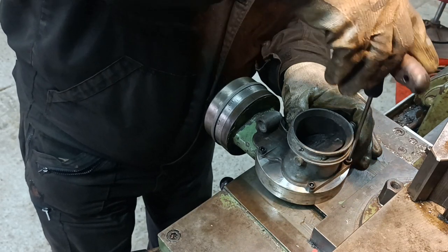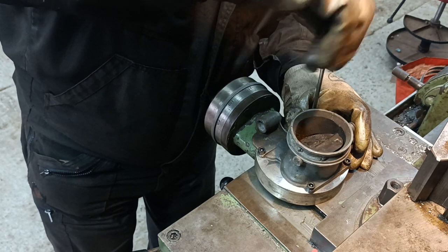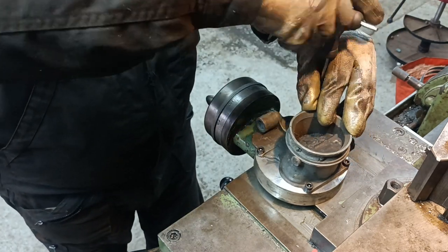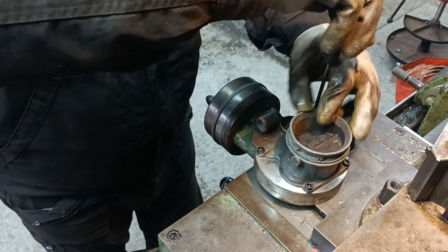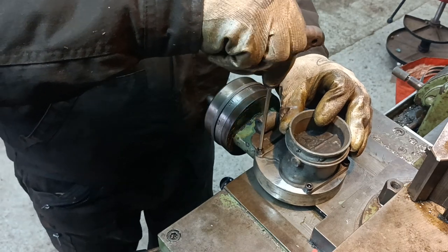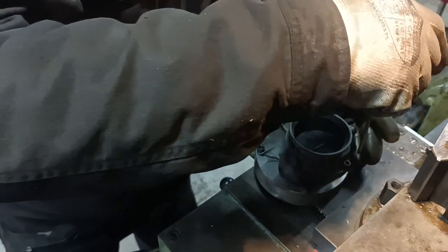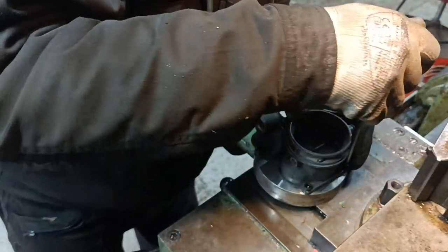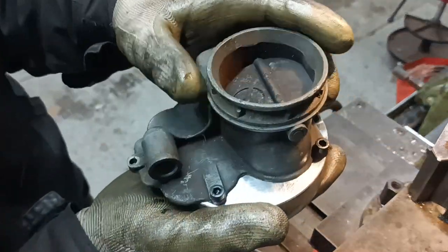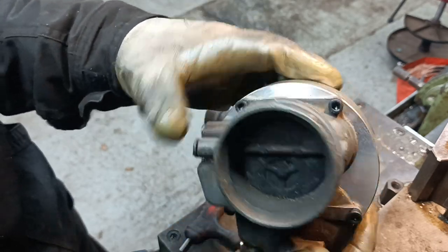That's not bad actually, because they've all gone in and started, and they're dead on size. Those holes I drilled, I've put a 5mm drill through the holes, and these are 5mm screws, and I've drilled and tapped the holes, and they've all lined up okay. I hope you can see that. So that's all screwed on now, look.